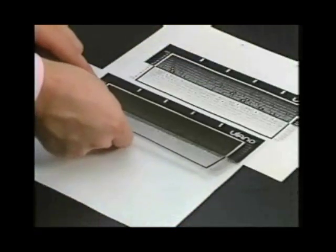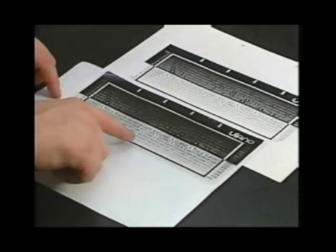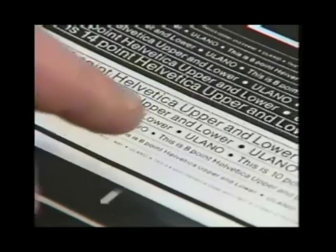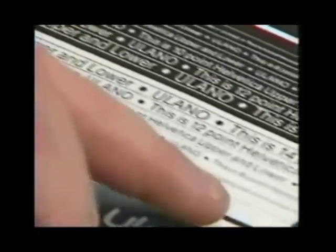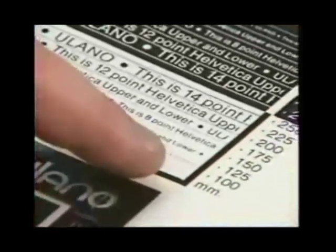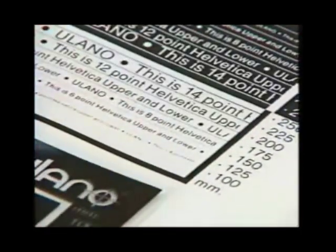After the print dries, compare it to the film positive. Usually the highest exposure consistent with resolution and adhesion requirements gives the best edge definition and greatest wear characteristics. But bear in mind that the finer the printed detail desired, the more carefully overexposure must be prevented.